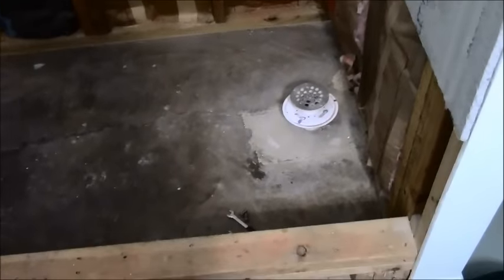And that is a danger that you face. This obviously got cracked from the pressure, which means I have to go even further down, which I would have had to anyway, because as you see, this was glued in here at that point. I got to get down to some bare pipe. Maybe even the P-trap.